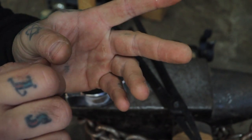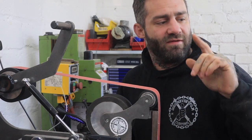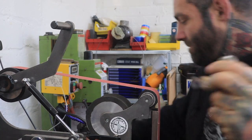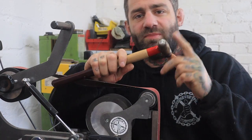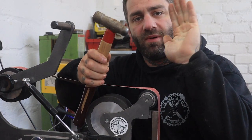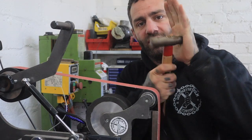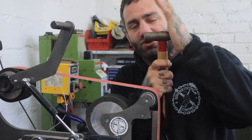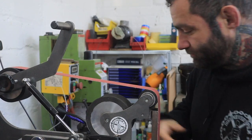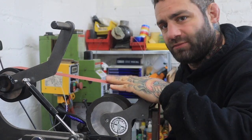Let's go over to the grinder. I'm going to be using my grinder, however you can just use sandpaper. I dressed the peen up on this yesterday so I could use it — all I did was put the sandpaper in the palm of my hand and rotated it around like so. It can be done to clean it up, but the grinder is going to be quicker.